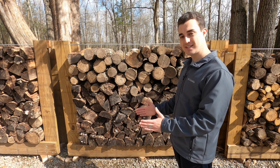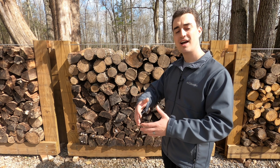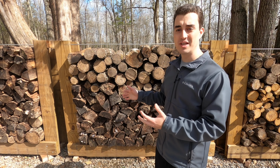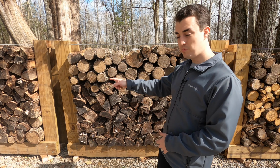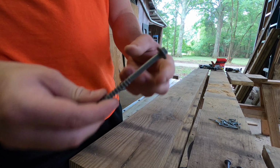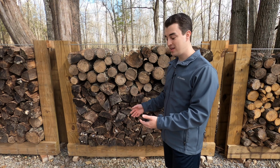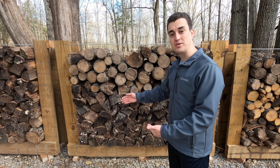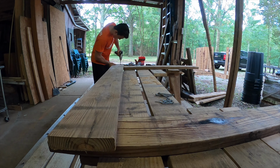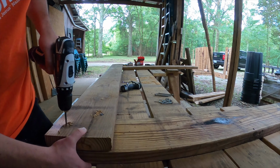And then those are connected by a 10-inch long piece that I also cut out of the floor joist. There's 3 of them, 1 on each end, 1 in the middle. First thing to do when you build it, it's very simple. You make your 2 U-shapes, or your 2 goalposts, both on each side. I actually took the 3/8 inch lag bolts from the deck and I repurposed those as well to attach the 5-foot vertical piece to the 7-foot horizontal piece. I just flushed up that 5-foot vertical piece on the end of the 7-foot horizontal piece, put the 2 bolts through, and that's how I fastened those together.